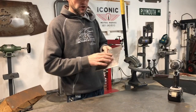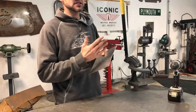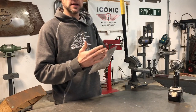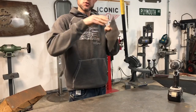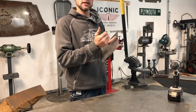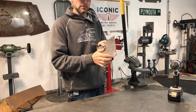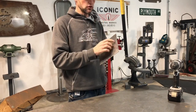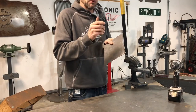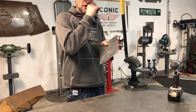So I'm going to show you how you can get a radius. Obviously it's the same aspect — if you want a two inch radius or a three inch radius, you would do it over a three inch span and do less than eight or ten degrees. The more increments you have, the less degree you use. On the first line, you might just bump it just to move the metal and then just keep going.